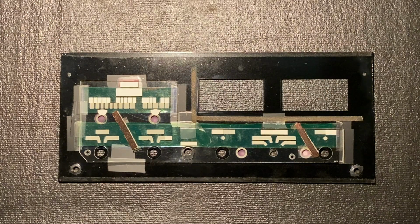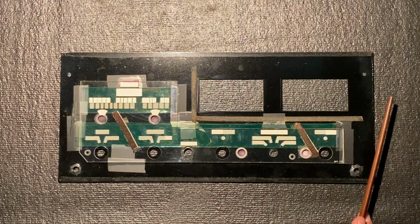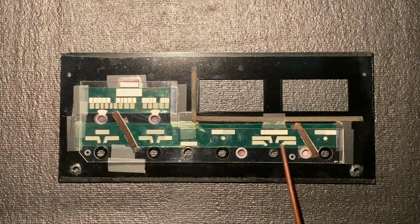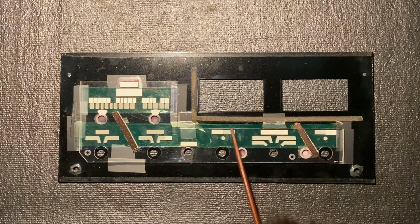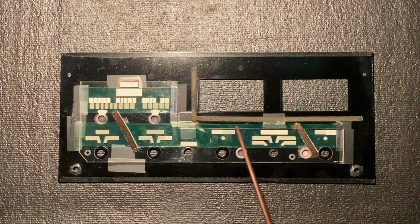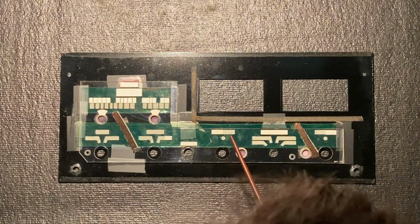Here's the back of the original glass dial, and you can see there's a lot going on here. There's a piece of clear plastic, which serves as a light channel, captures the light from the bulbs here and here, and here and here, and spreads it evenly throughout the back of the glass. Under the channel, you can see they've inserted these pieces of film to give the text in the dial a blue-green hue, and this is what I believe has faded. I'm not sure why. It seems as though they would create some color, but I'm just getting clear white.